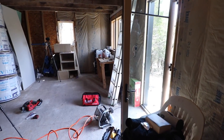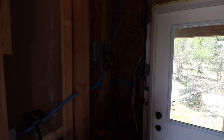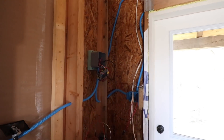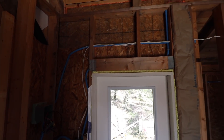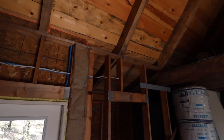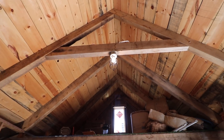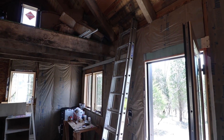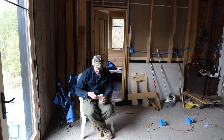And then we did the three-way switch. We've got the power source right here. We've got a fuse box in there — it looks like a mess. The power goes over into that box, and then up here, over here, and then it goes up the rafter into this light, and then down over here to that box right there. I can control it from the front door and the back door. I'm excited to have that light up there. It's been really tough filming at night — it's still going to be tough, it's not enough light, but it'll make it easier.